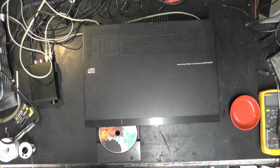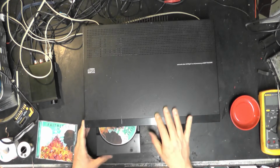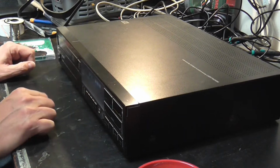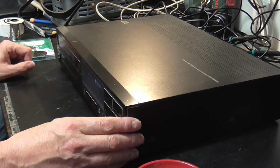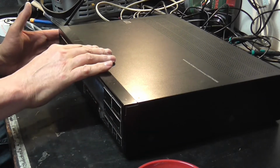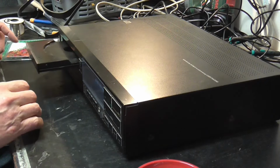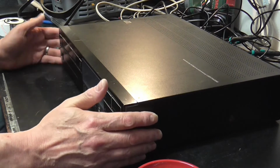Okay. So got a very sluggish tray motor for a start. Nope. Okay, go on. Have another go. Well, it's read the table of contents and come up with the track listing, which you can't see on the display now because I've got it level. So let's hit play. Yeah, well, that's playing. Fabulous. Okay, so it looks like our problem is with the sled. And looking at the speed that it's going in and out at, yeah, it's really bad. Okay, it's probably just a tray belt.